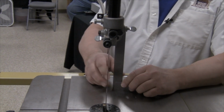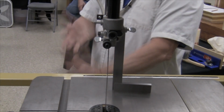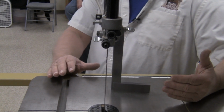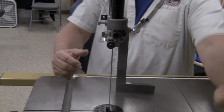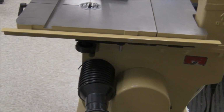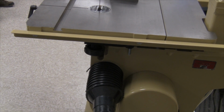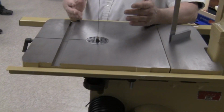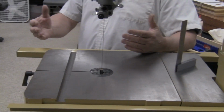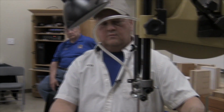There is a stop. You have a bolt, like a lot of things that have a trunnion. The default stop is going to stop right at the right spot. That's why I was shocked when it wasn't looking right there. So you have a bolt on this side, and all it is is a stud coming up. You can turn the bolt by hand, but you have a nut that locks it down. If you want to keep it straight, you make sure of it that way. I don't hardly ever change the angle of my table, but if you've got it right, you check it once in a while.